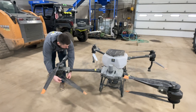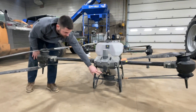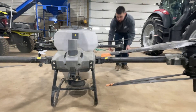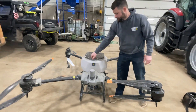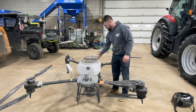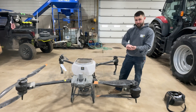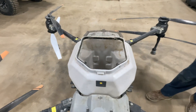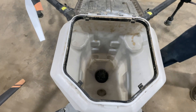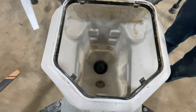You're actually looking at the front of the machine right now. Lights here, this is the radar on it and the camera there. Right now we've got the dry spreader in it — that's this big tank here. Really similar to like a floater truck or a spinner spreader. It's just got a plate on the bottom that's rotating and you can adjust that RPM to adjust your spread pattern. You see down in the tank there, there's an agitator just to keep product flowing correctly.